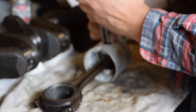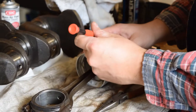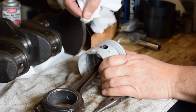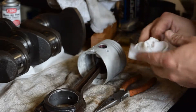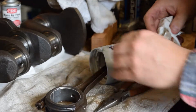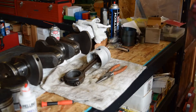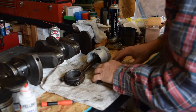I'm just putting in these retaining clips and they're going in rather easily. I'm cleaning up some extra lubrication. We still have the bearings in these journals — that's what they're called — and we're going to pull off those old bearings and put the new ones in.